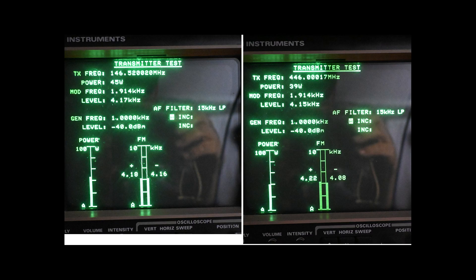Here are the results of our transmit tests on analog FM, VHF, and UHF. The key takeaways are: first, the wideband entitlement as specified works — the fact that one has to request such in a US market commercial radio is absurd. Second, the FM deviation measured at UHF and VHF is a tad under 4.2 kilohertz, which is good. Third, RF power output, although a tad under spec, is also good. And fourth, you can see the phenomenon of diminishing frequency error as frequency decreases, with UHF being 170 hertz and VHF being 20 hertz.